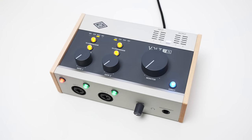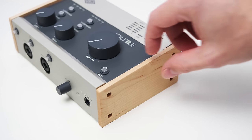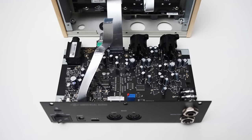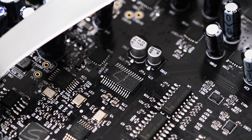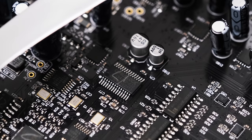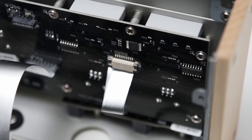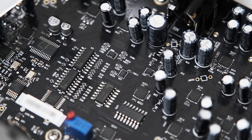The build quality is quite nice: the knobs turn smoothly, the housing is made out of solid metal, and even under the wooden covers you will find a metal plate for shielding. While I already have the interface apart, let's have a quick look inside. We can find similar components to the Volt 2, and I'm not surprised to find the same AD-DA converter, a Cirrus Logic CS4272. This converter can provide a good audio quality, but it is getting a bit old now and especially in an interface in the 276's price range I would have liked to see maybe a bit more premium audio conversion. But again, the best converter is worth nothing if it's badly implemented.